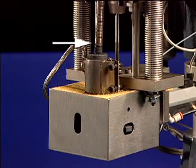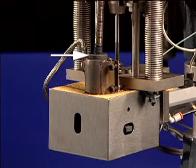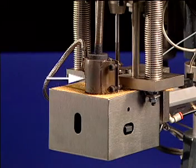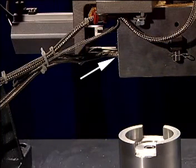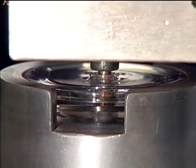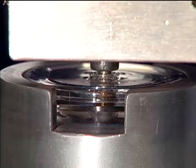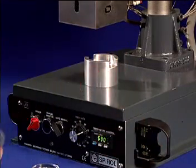The inserts are vertically stacked in the orientation head and are preheated by a band heater on the chimney as they advance into the main heat chamber. Here, they receive concentrated heat energy from two cartridge heaters, one on each side of the insert. Upon activation, the insert is pushed out of the machine into the host component. As the machine returns, the next insert drops into position.